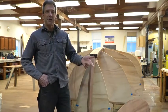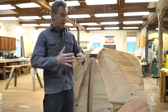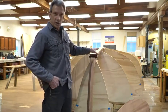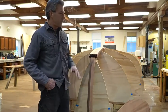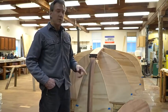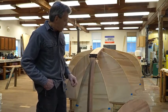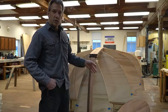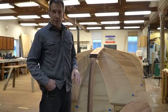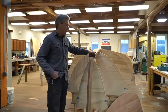On day one of construction, as opposed to having to loft the boat full size, we had a set of patterns that we traced out on plywood to make all these mold shapes. We were plotting molds and cutting them on day one, quickly moving toward getting the strongback set up with all the molds, and making sure the strongback itself was true, square and level. Other parts of the class were working on the stem lamination and prepping centerline parts.